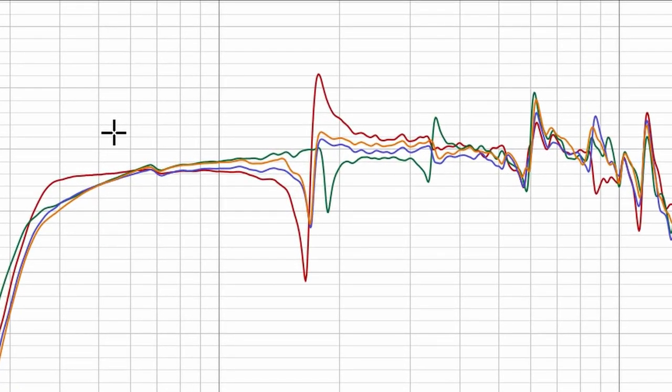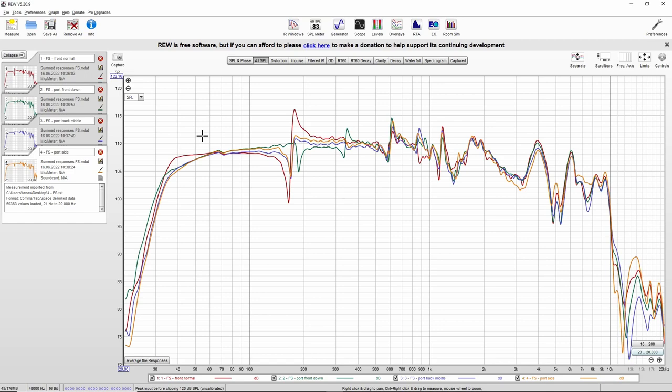However, if we look upwards in the frequency spectrum, we see this squiggly thing in the 100–200 Hz region. That is the standing wave doing all sorts of nasty stuff. If we look at the four responses, we can see that the initial response has the worst of it. We can see that the other three are better looking in terms of the standing wave. So while the low end response is better, the standing wave is also worse. Which response is better? In my opinion there is not much to debate — while the low end response is better, you need more damping material inside the box to tame that standing wave, which is much more potent. More damping material means less output from the bass reflex port. Remember the box losses we talked about earlier? Basically you win some, you lose some, and you're back in the same spot.